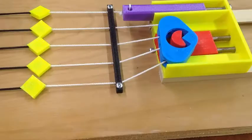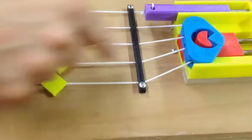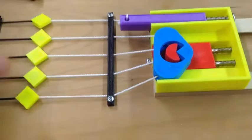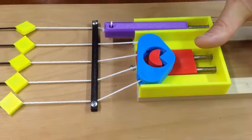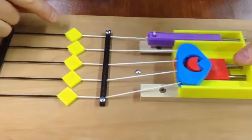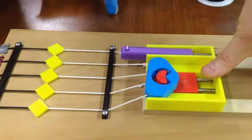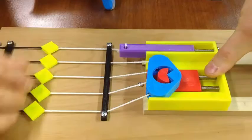This line on the first finger goes through a channel through to the second finger — so that's one tendon that goes between those two fingers through a channel within the Whipple Tree. Likewise, the third and fourth fingers have one line that goes up through here, through a channel, and back down to the fourth finger. The Whipple Tree can pivot on a pivot here, and when the whole unit — the Gripper Box — is pulled back as though you were bending the wrist within the enabled hand, then all of the thumb and fingers move. These yellow squares, or diamonds, are supposed to represent the motion of the thumb and the four individual fingers.